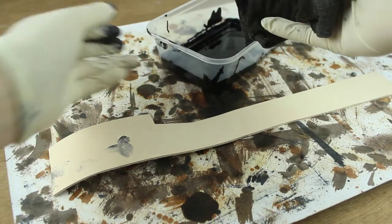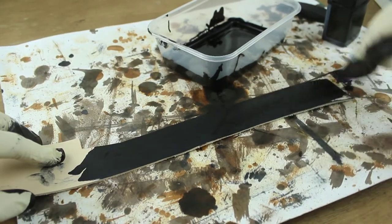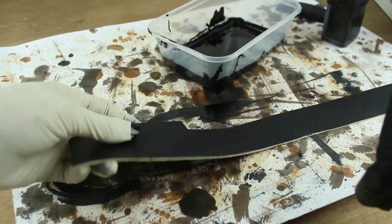Another method, which is a lot better for big pieces, is to use either a cloth or a sponge. You can cover a lot more surface area with a cloth — it's a lot quicker, and one coat will go further than one coat with the wool dauber; you'll get it more even. What I use for this is actually just an old t-shirt, but you can use any sort of cloth that doesn't have too many fibres that are going to pull off. You can also use dish sponges, and you actually get sponges designed for this exact purpose, which work really well too.